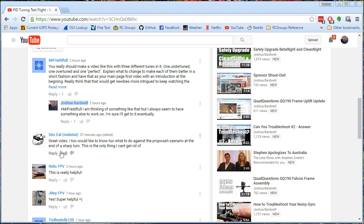So what can we do about this last little thing? A lot of the time I just say, screw it, I'm just going to go fly. Because there is a limit to what your copter is capable of doing with the ESCs it's got. The ESC's response — the braking and the throttle response of the ESC — is a big part of getting rid of prop wash. It's such a rapidly changing scenario that if the ESC can't drive the motor quickly in response, it'll get out of sync with the air moving over the prop and you'll get prop wash.